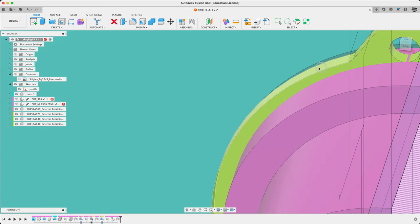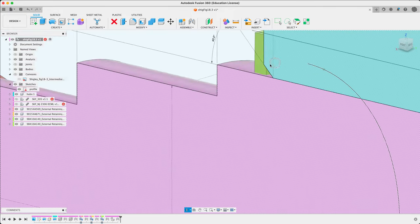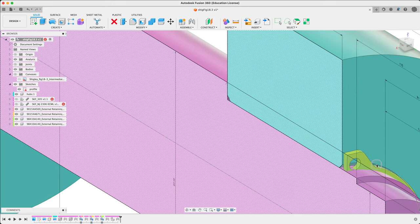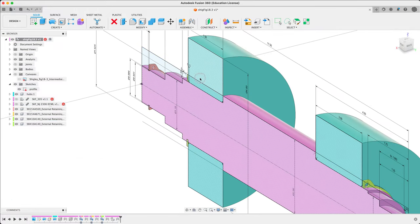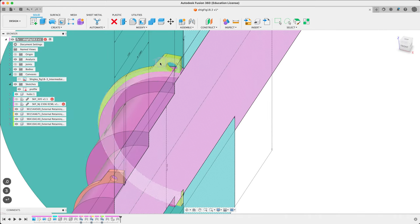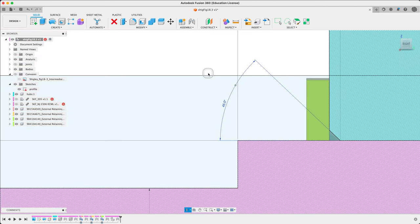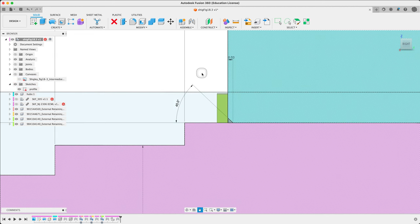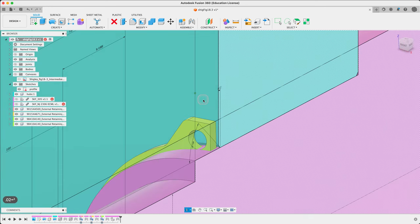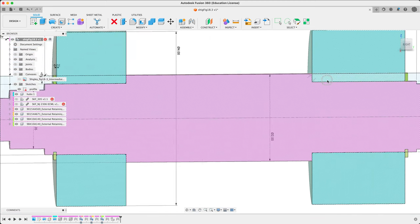Let's turn our analysis back on, just keeping an eye on that as we go. Make sure our joint is working correctly. One thing we can see here is that our chamfer is way too big. So let's turn our sketch on, go ahead and figure out what's going on. 0.15 is what I picked before — let's go down to 0.05. That looks better. Key thing is to make sure we're not sticking out here. But it's not great yet because our ring groove is still poking out past — still too big. Let's go smaller: 0.03. Better. Borderline, still 0.02. I can almost see it.